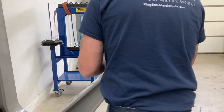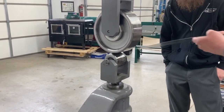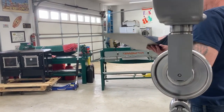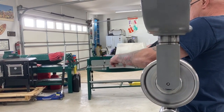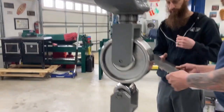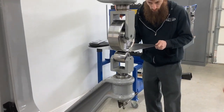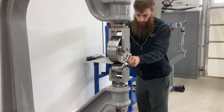I'm traveling backwards and forwards, coming across that panel and giving all my tracking marks overlapping just a little bit each one. I'm also coming as close to the end of the panel as possible without running off — I'm within three quarters of an inch and you have about an inch and a half. See if you can try that for me. The whole idea is that we're going to go as smooth as possible and keep close, slightly overlapping each one.